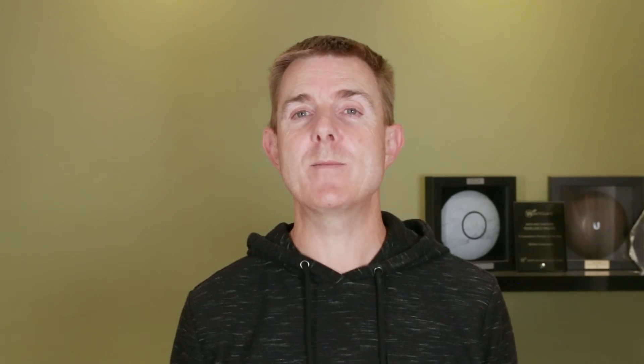That doesn't mean it will be super slow — it depends on what you need to achieve and which devices you use. You can have devices that will create a point-to-point connection and provide you over a gigabit a second between each device, the same as you'd get from an ethernet cable. For example, these are two Ubiquiti nanobeams — put these 500 meters apart, a kilometer apart, and they will create a connection between two locations as if an ethernet cable had been run between them. This creates a reliable way to connect devices together, and that's why it's the most reliable way to get connectivity to devices more than 30 to 40 meters away from a normal home-grade wireless access point or router.